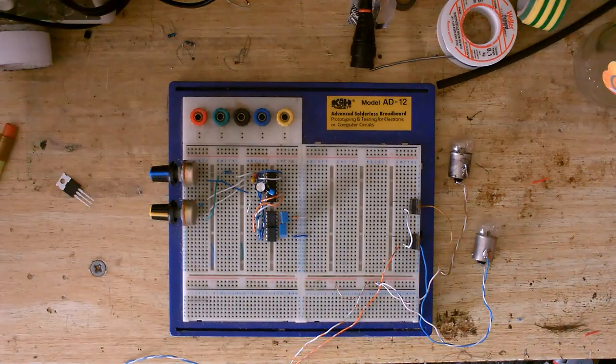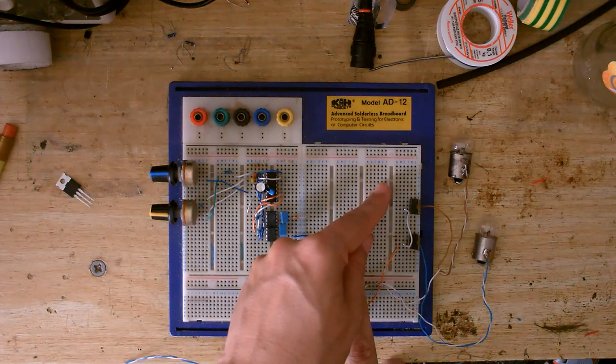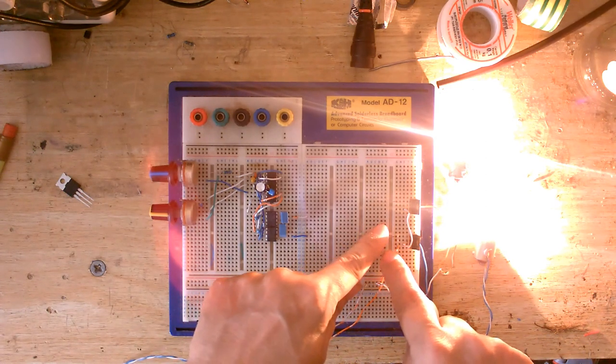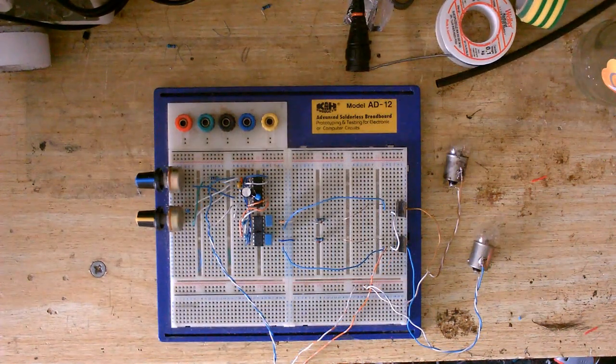And here we are back at the breadboard. If you look closely you can see a couple of exposed wires — this one goes to the negative of the power supply which is also ground, and this one goes to the positive. So let's see if this works. I'm going to touch the positive with one hand and charge the gates of the MOSFETs with my other hand. That one's working, and this one's working — the lights are swamping out the camera but it shows these MOSFETs are working. Now if I touch the ground and then touch the MOSFET gates I can turn the lights off. So yeah, these two MOSFETs are good. Maybe you can hear the cat in the background — 'food food food, I haven't eaten in three minutes, I'm going to wither and die.'